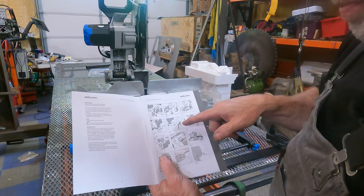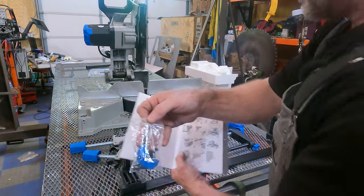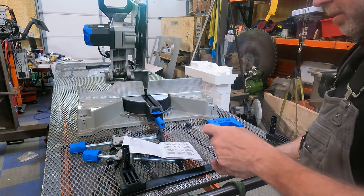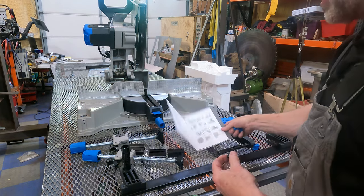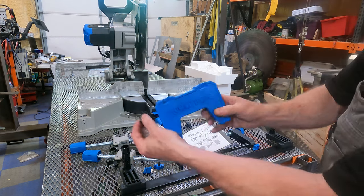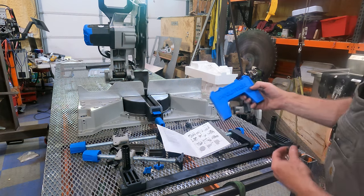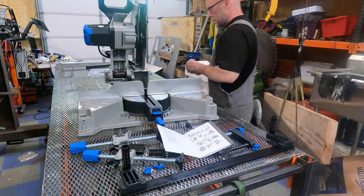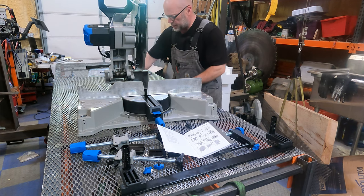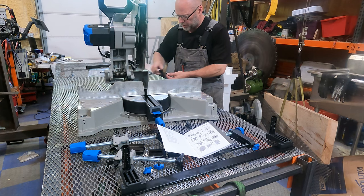There's a locking pin with a retaining clip — pull that clip out to lock it in place. You can lock it in three different positions, and then there's a little clamp to tighten it so even if the pin gets removed it doesn't come off. Next we put a support on the back end with two small screws. I noticed when the assembly was all the way to the rear it was a little tippy, so this piece is actually there to stabilize it. It goes on the back side with a couple of screws through the top to hold it onto the rear bars.